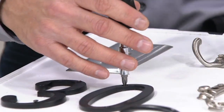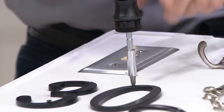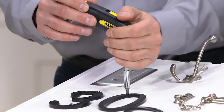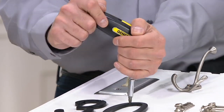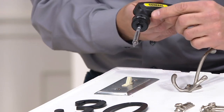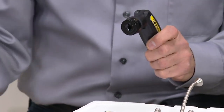You've got to have a separate screwdriver for Torx, but now you have two bits in a very common size. While we were talking, I turned this into something that gives you so much more torque. Using your wrist alone is hard, but using it this way with a 60-degree bend is a lot easier to tighten and break something free. And once it's in this position, there's a simple little chuck here that says lock and open — you twist it to open.